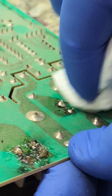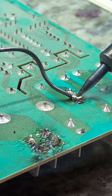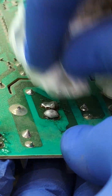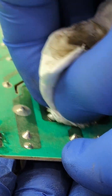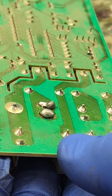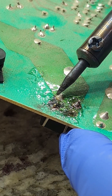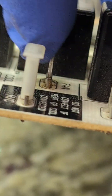I start off with the fan speed connector. I actually had to scratch away some of the darker green area to get more room to solder to the connection. Now we can basically do the same to the other pins that were there with the burn mark. You can see the fan pin no longer moves, so that's a good thing.